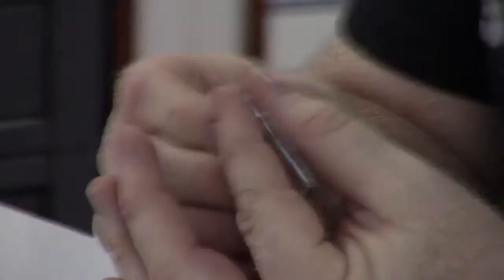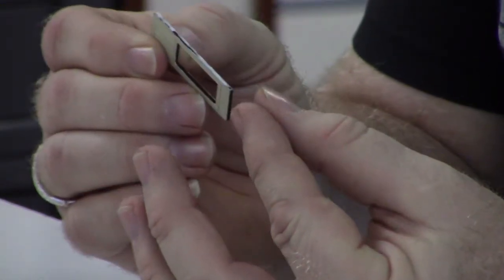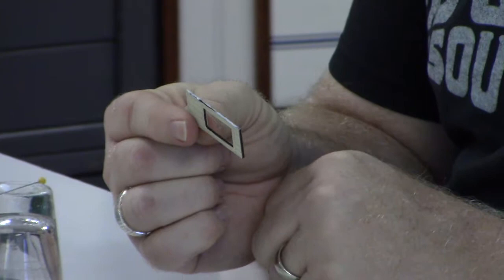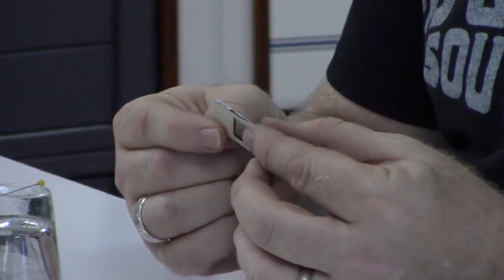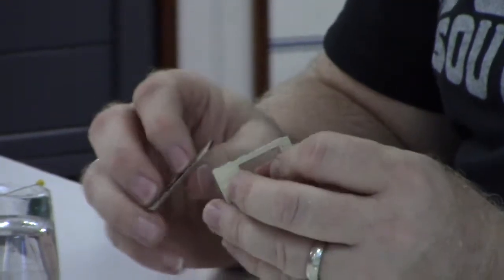So you kind of see how I've got it in here? I'll take my thumb and my forefinger and then I'll just pull the part out. Never push it, pull it out. What that'll do is take any of the extra and rub it out on my thumb and my finger and leave me just a nice little fine bead of glue right there on the surface. And your finger and your thumb protect that from rocking down onto the painted surface. And it gives you a really nice little bead of glue and should keep you from having too much squeeze out.